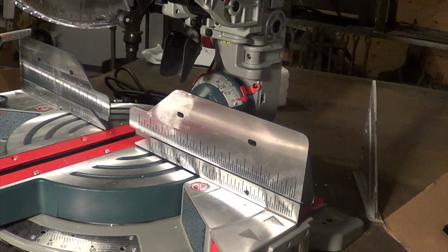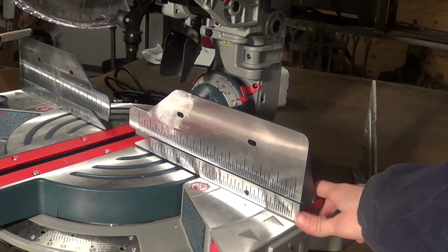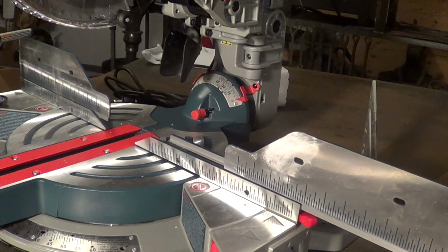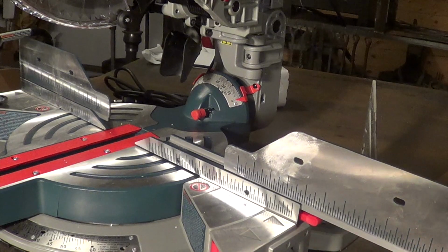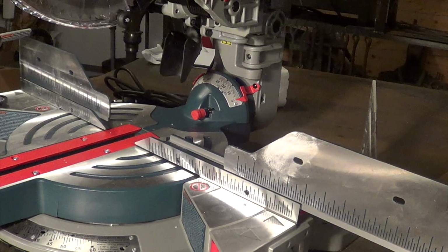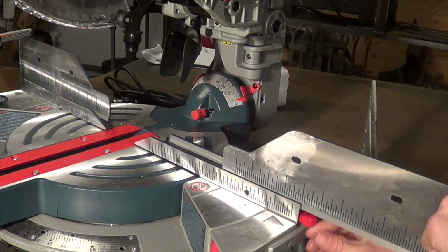Obviously, this is a top of the line saw, but for whatever reason, there is a red lever over on the side here, and if I throw that, these will actually slide down. And I know you can see that they move up and down a little bit, but as soon as you throw that lever, it takes all movement out of the rail. And also I just touched that rail. Everything's pre-lubricated, which I could foresee dust collection right there being a slight problem in the future. You know, right in here there's some grease. So that's just something I'll have to keep an eye on.